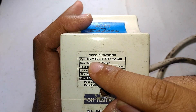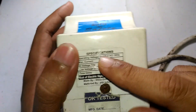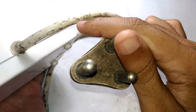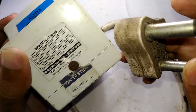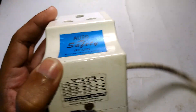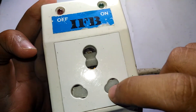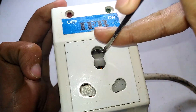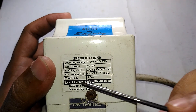The operating voltage is around 0 to 440 volts AC at 50 Hz, with a maximum current of 16 amps. The cable is really thick, and looking at the pin size it's quite substantial — though it was lying in my attic so it's dirty. This plug is rated for 16 amps and the wires are also rated for 16 amps. The plug is the protected kind — the protection mechanism inside will only activate when a proper plug is inserted.